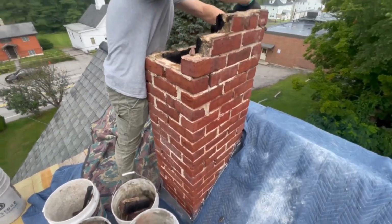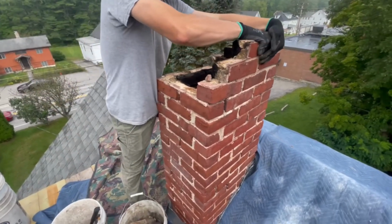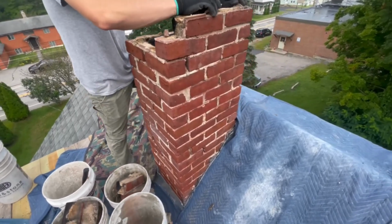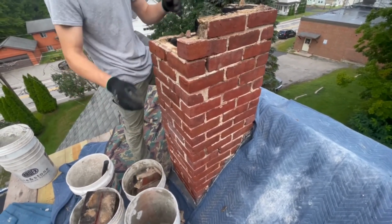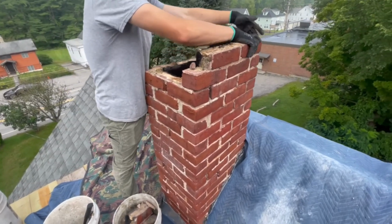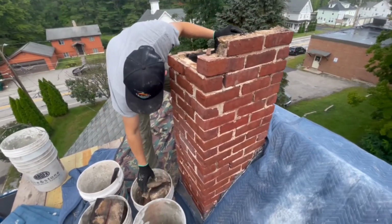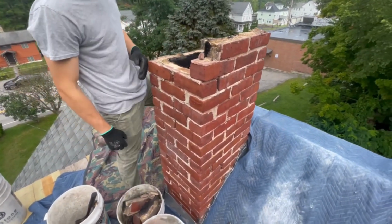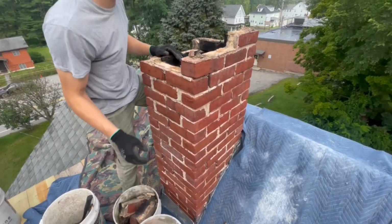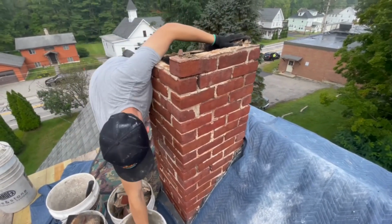As long as you know that your chimney's unlined and it's in rough shape, and carbon monoxide detectors in the house are super important when you have an old house, old chimney. You just have to know. They're going to give you your first warning. People don't want to buy them because they're $30 to $60 or whatever, but just buy a couple to have in your house. It's really good peace of mind. You'd never know if this was leaking in your house, sometimes until it's too late. So, one step at a time.